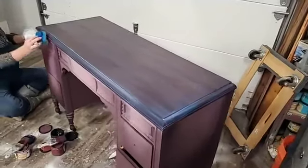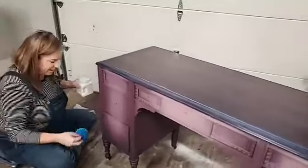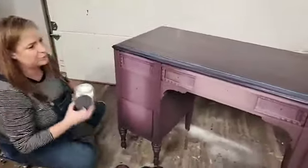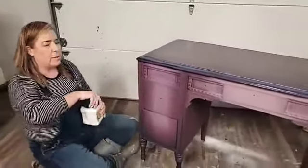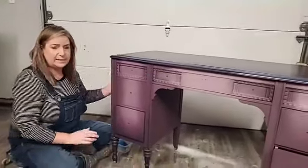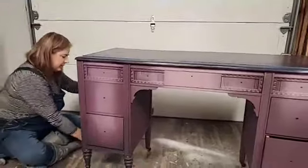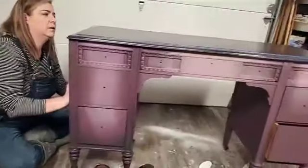Okay, so that is super smooth. That's 2 coats of clear that I just did. We've been on for about a half an hour, and I've got 2 coats of clear, of the probably 5 I'll do on a wood stain top. So when I say 5, it sounds like a lot, but it really doesn't take me that much time. I'm going to run through this side with you really quick, and then we'll get off for tonight.